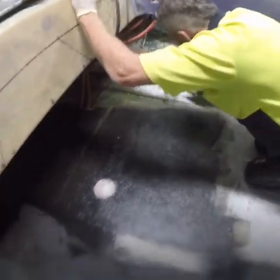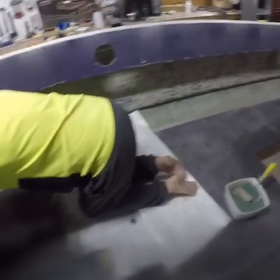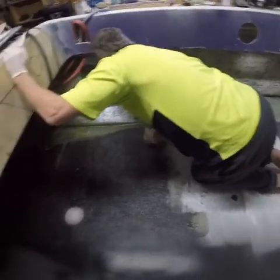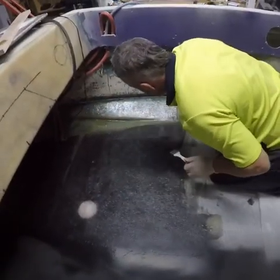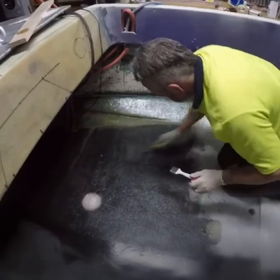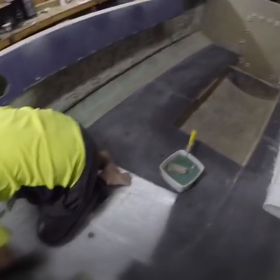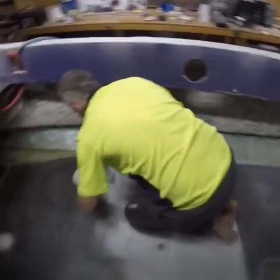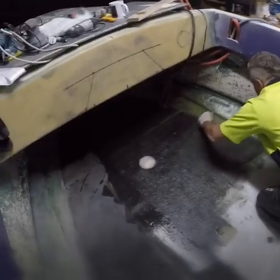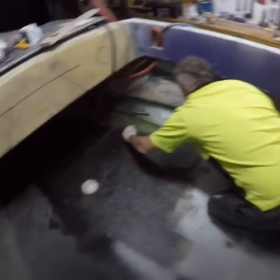This is what we're up to so far. We've done the front, filling that side. That's the hole for where we're gonna have the fuel filler. We've finished the keel tank. Now we're just giving it a layer of 600 woven roving. Hopefully we can start moving on to different areas of the boat and get rid of this floor — we're over it. New product, the Thermolite, so we're giving it a shot — no rot. Hopefully it stands up to its expectations. We'll keep you updated.